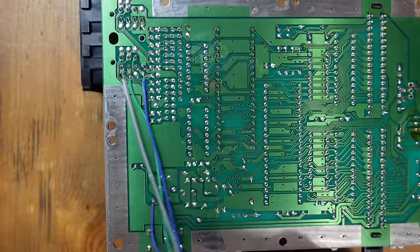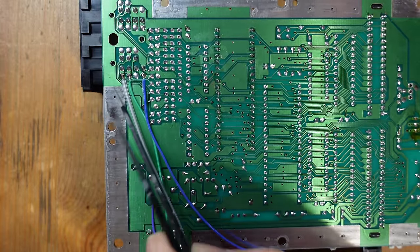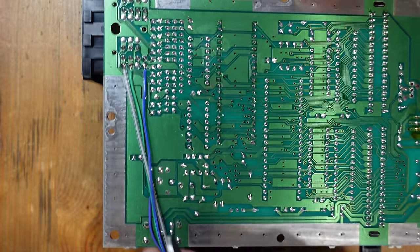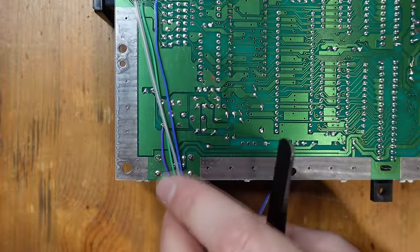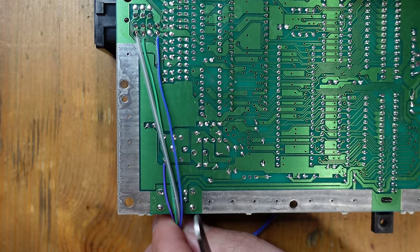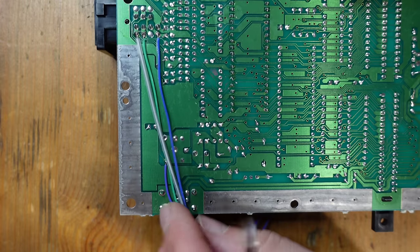So what I'm gonna do is connect those up to the NESRGB board. And you can see I have them all pointing this way. That's because there's a spot under the shell right where the power switch is, which is cut open. So it means that you can easily route these wires underneath without getting them caught on anything or having to cut the shell of the console. So that's what we have all set up here.